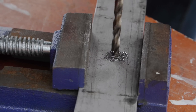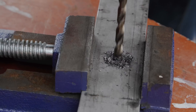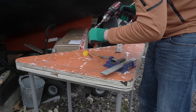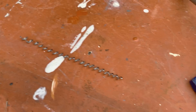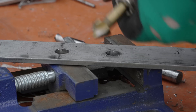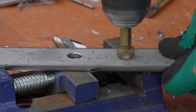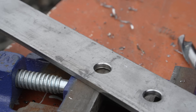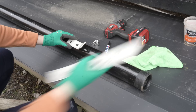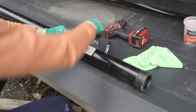The stainless steel drilling was as entertaining as normal, running up from 6, 8, 10, and then 12mm drill bits. I'm using cutting paste — so you don't tell me off — and achieved a lifetime top-ten standard length of swarf. To cast aside any unjust accusations of amateurism, we finish off with a quick countersink, and so I've moved directly to the assembly line. We all know how when using a hand drill you can sometimes get holes half or even a whole millimetre out when lined up in a stack of materials, but this time we got away with it.